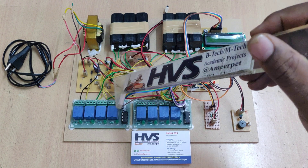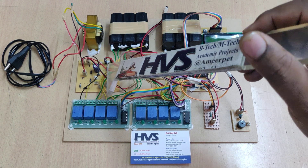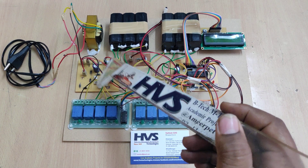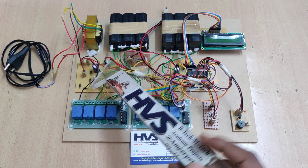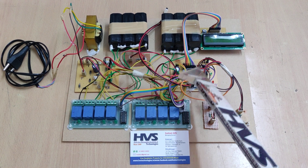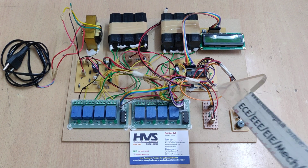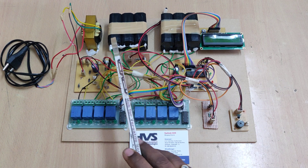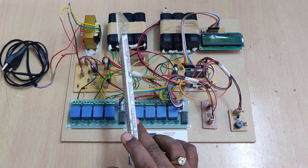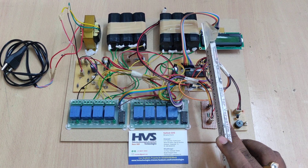The regulated power supply board has three or four stages: rectification, filtration, and regulation — to convert AC to pure DC 5 volts. When 5V DC is supplied to the microcontroller, it starts reading input from the two battery packs via voltage sensors, and controls and isolates each battery cell from the pack to measure the individual battery voltages, which are continuously displayed on screen.